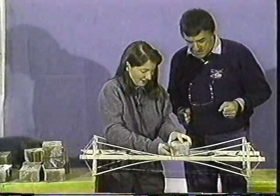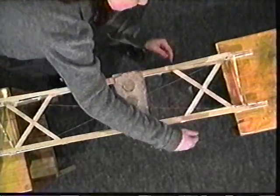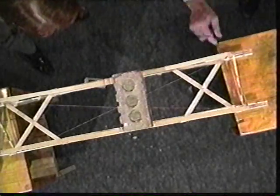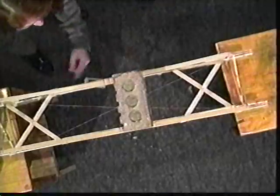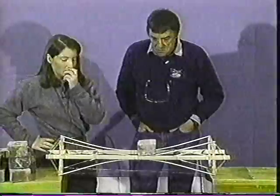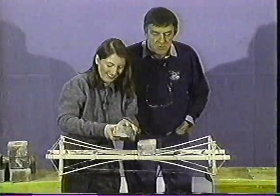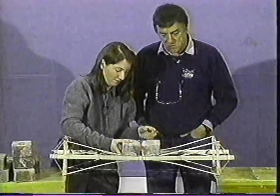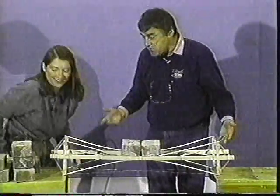Where do you think it's going to break? Somewhere along here, around here. It depends — this is quite a hefty built-up member, this one and that one. I cross-braced it before; it was really unstable so the load just slid off. Maybe it won't break. You've got two or three mechanisms going on here. It's what we say in England: belt and braces. The Englishman never trusts a belt to hold his trousers up, so he wears suspenders as well. That's fair enough, because if one fails, you've got the other one.